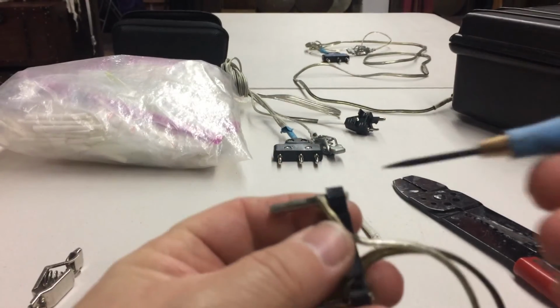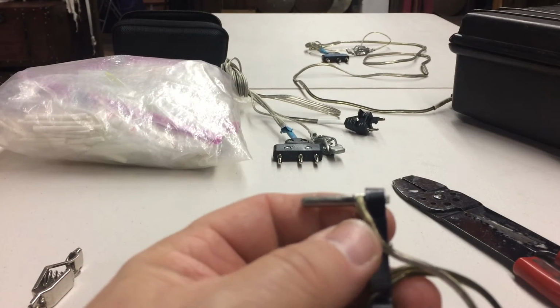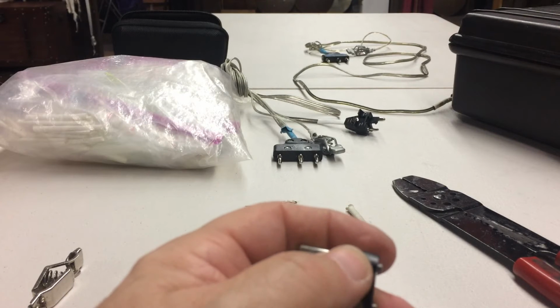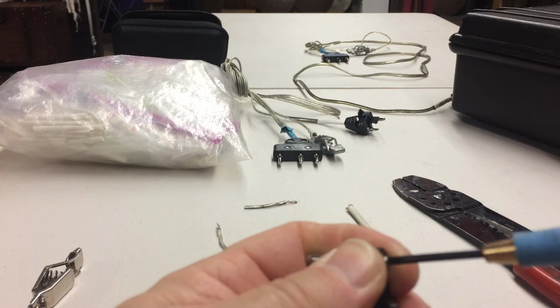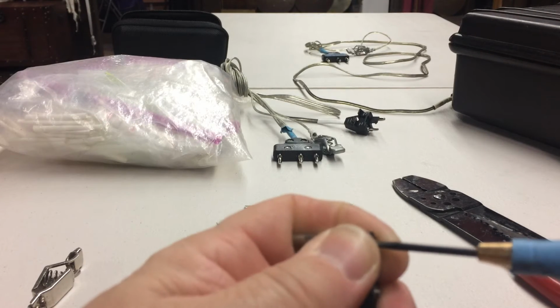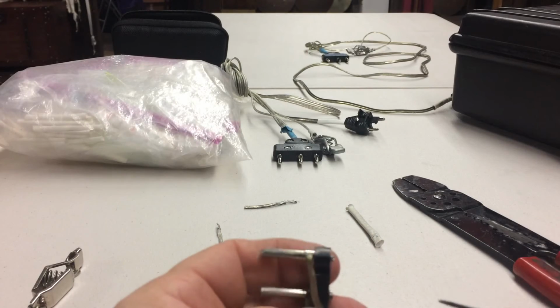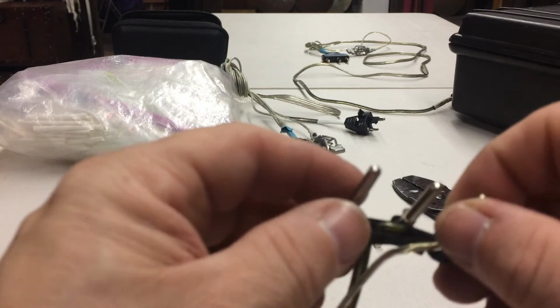The problem we come up with is you have a copper wire and a steel screw with the tissue going through it, so you get corrosion, and it can really bring the resistance very high. So what do you do? Very simple. Put on the screw, undo it a little bit, go back down a little bit, nice and tight, and you will have broken the corrosion off, and you'll see the resistance will drop like a rock. That's the issue on the front side.